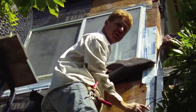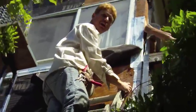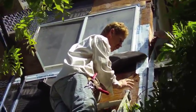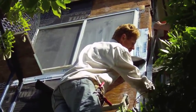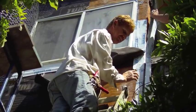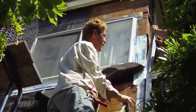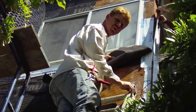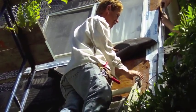What's really important — a lot of people think you can just break to the corner here, that's a shortcut. That shortcut can cause a tremendous amount of damage, so there are no shortcuts. You have to take it around the corner. We took it to this sliding glass door — that way we get a nice even seal — and we are still going to go over this with two more layers of paper. Anyhow, that's it for the lap. Now we're going to finish up all the paper and wire and staple everything off.